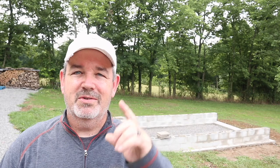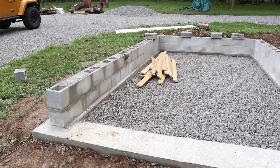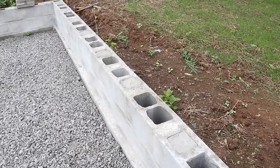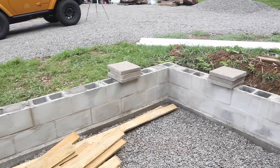Welcome to another morning in the greenhouse build out here on the TNT farm. Before it gets too hot and muggy, let me walk you through our progress on the foundation to date. So far we've finished up the three CMU block walls — one is still a little wet because I finished it last night. We also came back and filled the rebar columns with concrete, because those are going to be anchor points for the wood framing, which will be in the next video. Today's goal is to cap this wall with 12-inch pavestones.